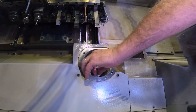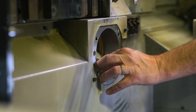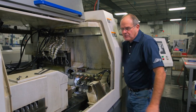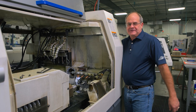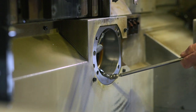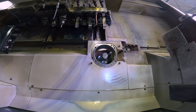We bring the indicator up to the bore — it's pretty sensitive. We have the indicator zeroed out at the six o'clock position. Moving to nine o'clock, we're a couple of tenths — that's good. Coming around to the twelve o'clock position, I'll need a mirror for that — also about two tenths, which is excellent.